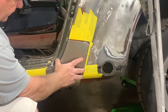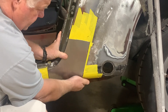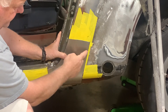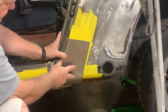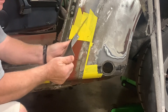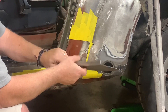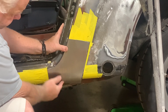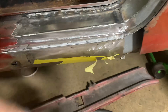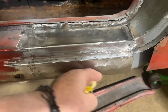What do you think about that, guys? We've got to cut this out, but what I'll do is remove the yellow tape and cut the back panels out as I'm putting this new panel in — that way it keeps everything straight. Got to curl it around when we get finished. This bend right here is just a little bit off. This part up here is all rigid because we put this bend right here and there around the door jamb.